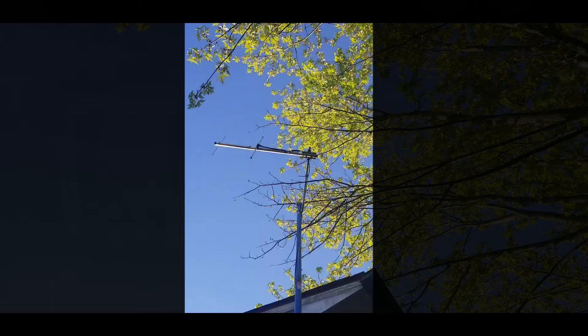As you can tell, there's a really dramatic difference between receiving at my location using even a small directional antenna like a 2-meter Yagi versus an omnidirectional J-pole. The J-pole works great for regional repeaters within 30, maybe 40 miles. But getting to the club repeater — again, about 61 miles away — I can hear that repeater very scratchy sometimes and can't really get into it on the return. We have Echolink here at LCARA, and I've used that quite a bit in the last year or more, and that's a great service for clubs that have that.